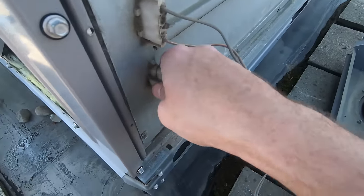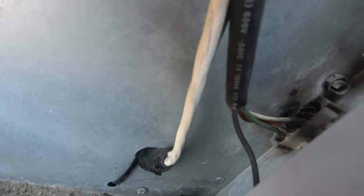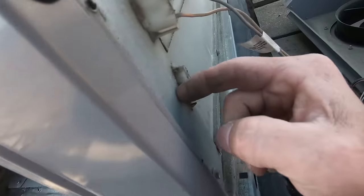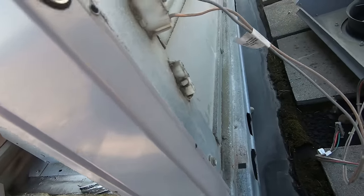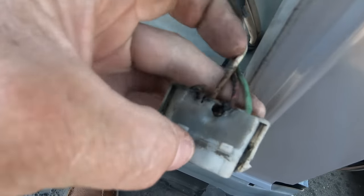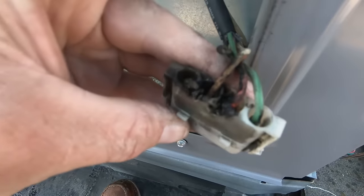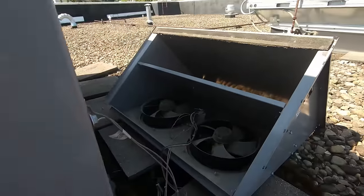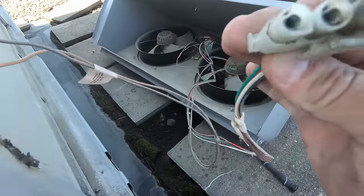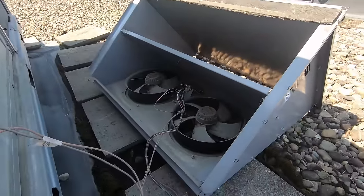This is the one that's all burned up. Because if we come back to replace, we're gonna have to either replace this plug or knock it out, put a box connector in, run my wires through it and wire-nut everything together. Let me pop that out so I can get some pictures. As you can see, it got awfully hot - it melted the plastic and everything on this side. This side of the plug doesn't look too bad. Looks like it got a little warm right there but it's not melted.